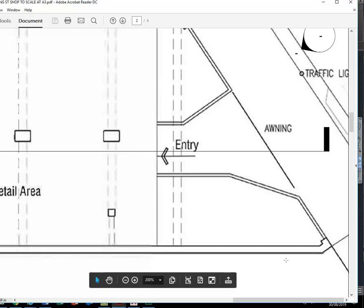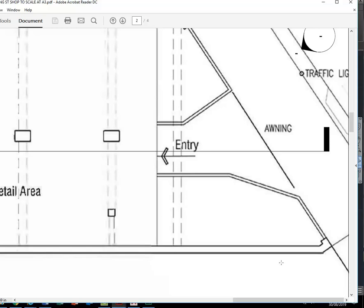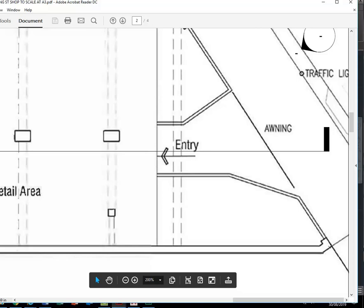And so to set that out, okay, so it's 300 by 250. 300, and then you're measuring through. Exactly, at right angles. That's right. So here, if you're wondering, I'll just make it clear. From this corner, I've measured across, not to here, not to the street, but to where this point would come down. In other words, we're measuring at a right angle. So again, 300 across is the measurement I've taken, and then up 250.